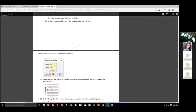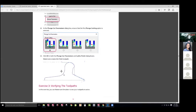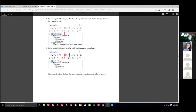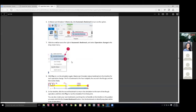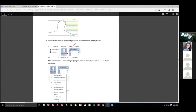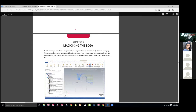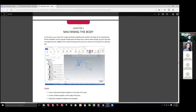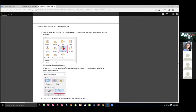We'll go back to the document. The students follow through this document. We talk about plunge parameters. I'm not really about changing because that's the default. We're going to get into this because we're going to have to set these values so the tool will come behind here. It's one of the neat things about Mastercam — I like the way to control the plunges. As you verify it, we continue on. I'm not going to worry about the bookmarks. They can learn that later. We'll get to the last part here, which is the dynamic. We're going to do some dynamic toolpath, dynamic roughing here with this on a lathe, which I think is crazy outstanding.